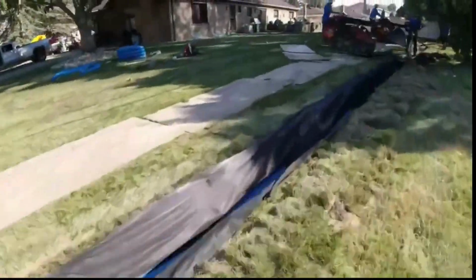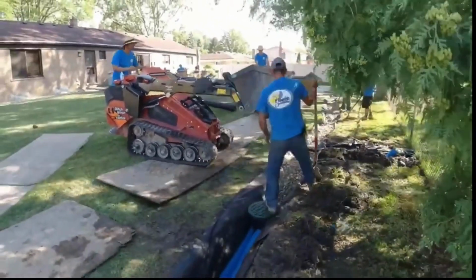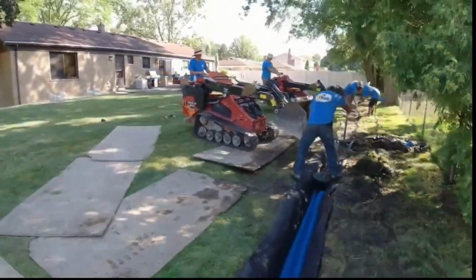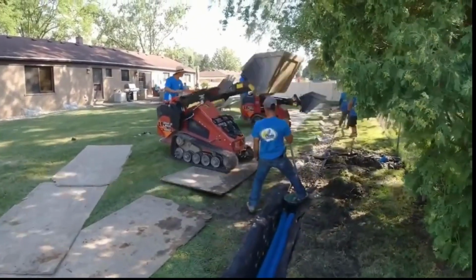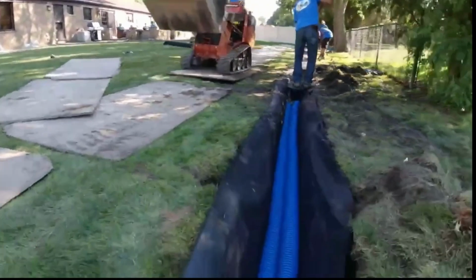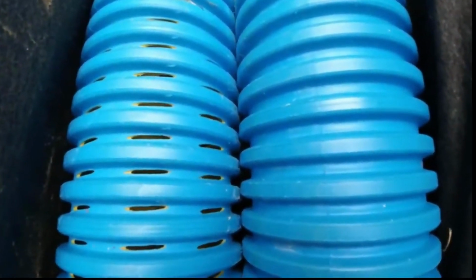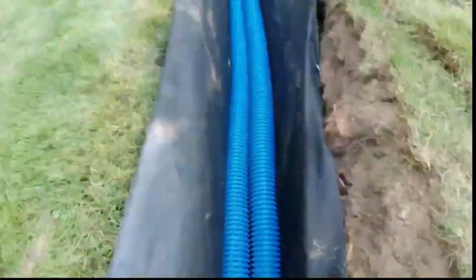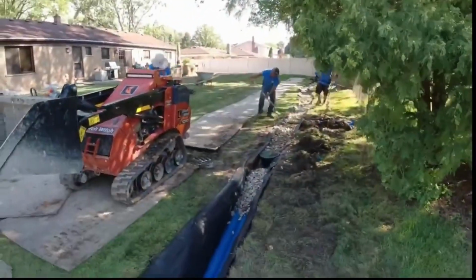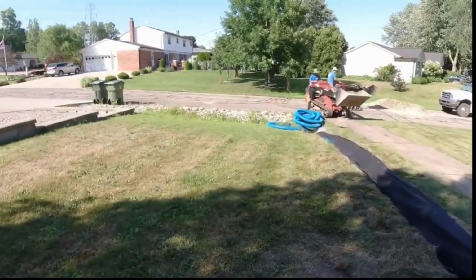There you go. Solid high octane, 8-slot high octane. Both. Those are FDM's high octane yard drainage pipe manufactured by the Boffman Tile Company. So we're packing stone in the system because we're going to burrito wrap it like we do all of our systems. The yard drain's built inside it, but look at that, it can't contaminate our French drain system because it's a solid pipe. Dirt can't go inside the 8-slot. So that royal blue pipe is high octane.